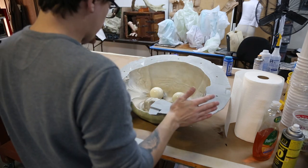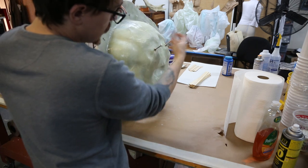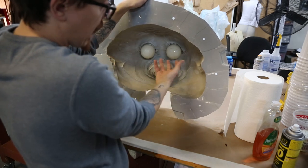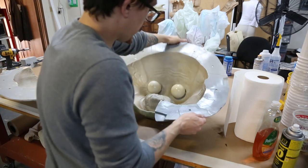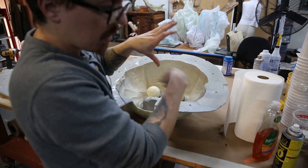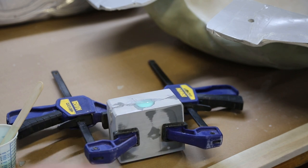That's all the prep I did for the mold. I have my epoxy eyes in here — we drilled and threaded holes in the epoxy eyes that we cast already. This will give us perfect eye sphere negative spaces that we'll then put our resin eyes into. So we'll have nice big full sockets. We're casting around those balls, and when we demold we'll unscrew and pop the head out with those epoxy balls still inside, then spritz some 99% alcohol in there and pop them out for perfect ball sockets. This material is called 1630, a mixable epoxy resin.